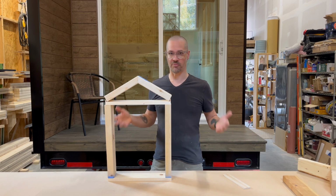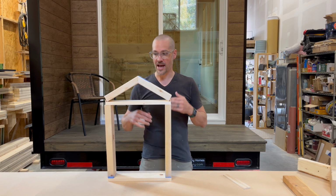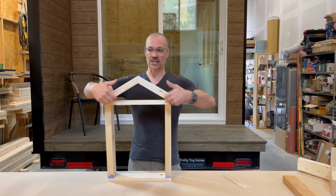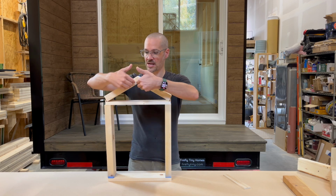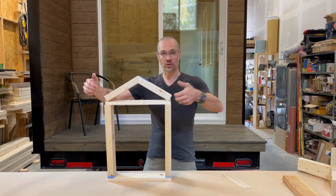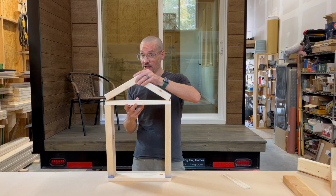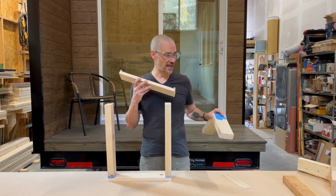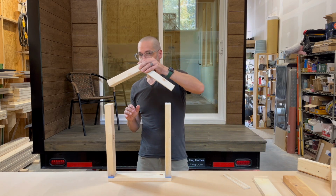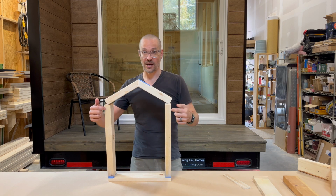Now, you say, you've been in houses, you've seen tiny houses that don't have ceiling joists and have just a big vaulted ceiling. You can accomplish that with pre-engineered trusses called scissor trusses that come up at a slightly lesser angle and give you that vaulted roof sense. Or you can get rid of the ceiling joists altogether, in which case I want to show you what happens if you just put hand-cut rafters right on top of the walls here.